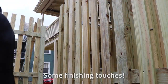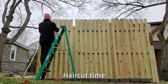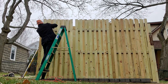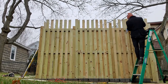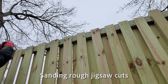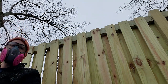Some of these finishing touches, like putting the gate latch in and putting these coat racks up, were all just fun. I had taken so long to get here that I was just happy to be here. This part was significantly less fun — I used boards down to a little bit below those 4x4 fence posts. This took a very long time, and I realized only at the very end that I should have just used a speed square and cut it with my jigsaw. It took me three and a half sides to figure that out. Went back with a sander and cleaned everything up. And this, my friends, is the final thing that I did — well, I also put the lamps on top of the posts. This was the final touch before the big reveal.